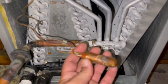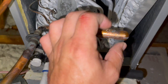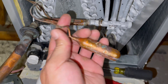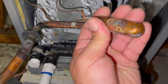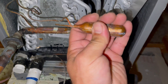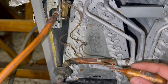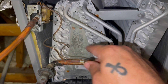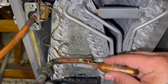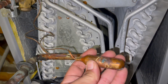And I do believe this bulb has lost its charge. I wish I could explain it better to you, but you can just feel the way it sounds and how extremely light it feels. It's a really hard thing to describe, but if you've felt several of them and then feel one that has lost its charge, you can feel just by touching it the difference. If you know anything about TXVs, the bulb is the opening force for the TXV. So without that charge, it is not able to pressurize the refrigerant in the bulb and open that valve. It feels like our bulb has lost its charge — which is our problem.